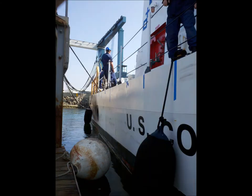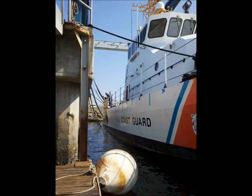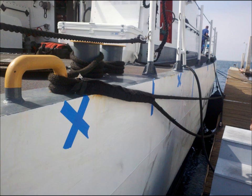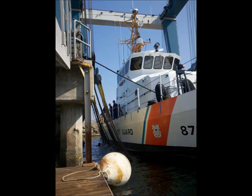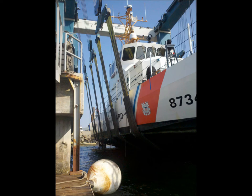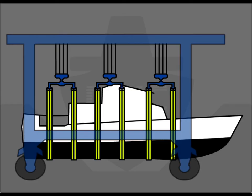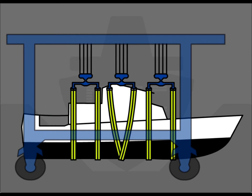Here, the ship enters the pickup location. This time, the plans tell them which frames to lift on, and they've marked out these frames. They slide the straps under and begin to lift, but their load cells indicate the ship is not balanced on the lift. The solution is to cross two of the straps on one frame, and shift two of the other straps to balance the load.